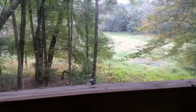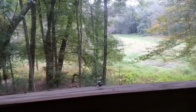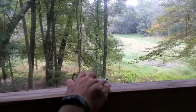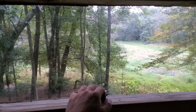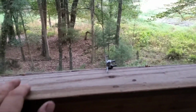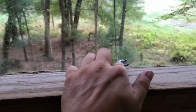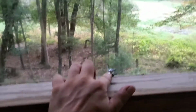And we're back. 3 months later, I actually came up with a solution for my windows here. So I took some 1/16 inch steel cable, some cable stops, and I drilled some holes, and I have a cable system for my window to open, so I'll show you how I did that. So I went across halfway on my window and I drilled a hole through the polycarbonate about an inch up. And I went up here and I drilled a hole up there, ran the cable through, and I made a loop up here and I put a hook up there.